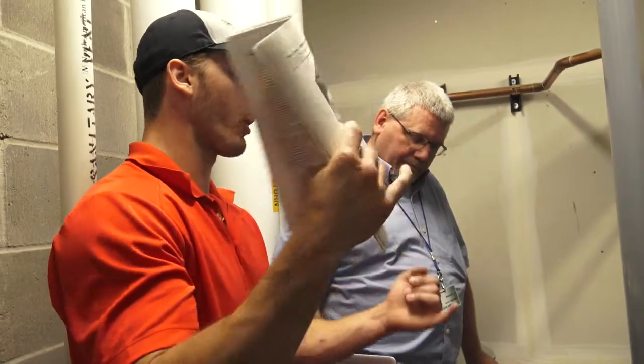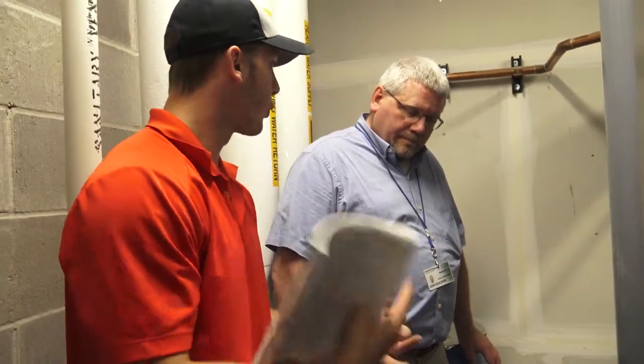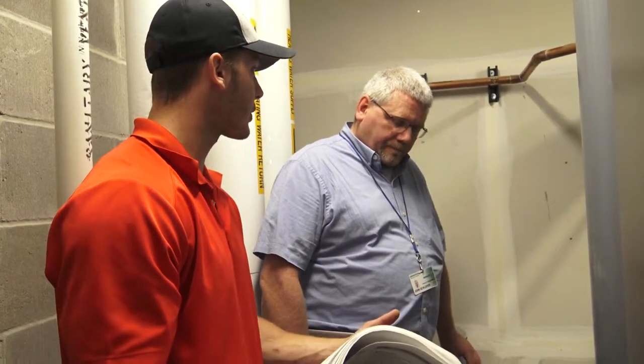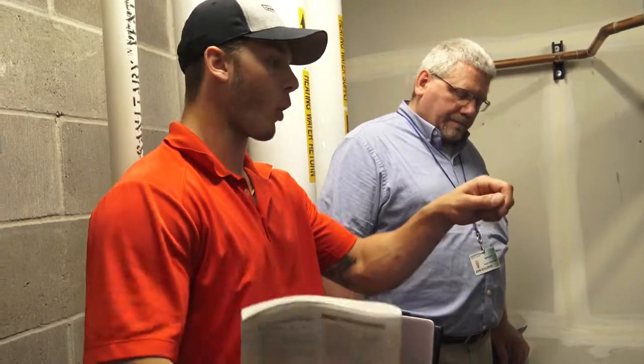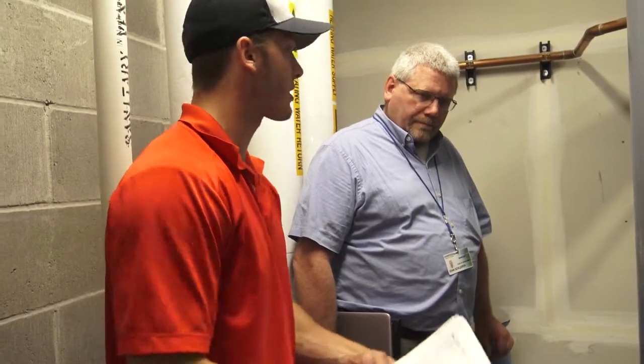So, yearly inspection. Personally, if it was me, and what they recommend, is new igniters, new flame sensors, and clean the burner once a year. Inspect the heat exchanger. On top, it's pretty self-explanatory. Remove the bolts, take off the top plate, pull the burner straight out, and take an air hose and blow it out. It is a metal mesh burner, so you can spray it down with water. Doesn't matter how you clean it. I wouldn't be gunking soap and stuff on there, but water and air are definitely acceptable.